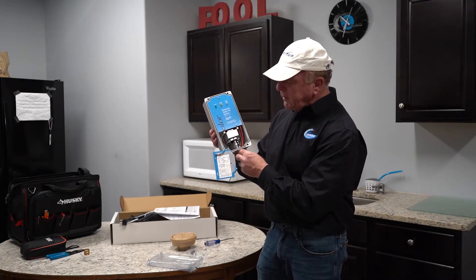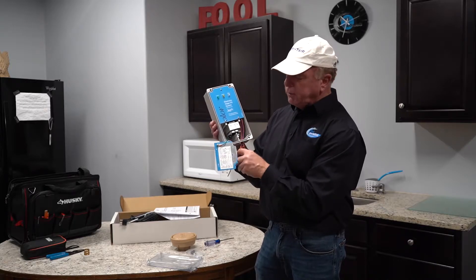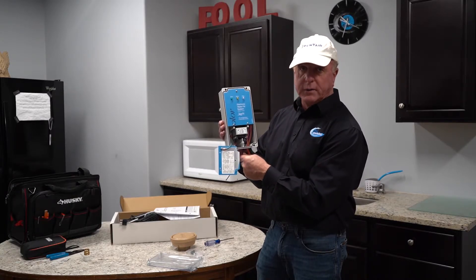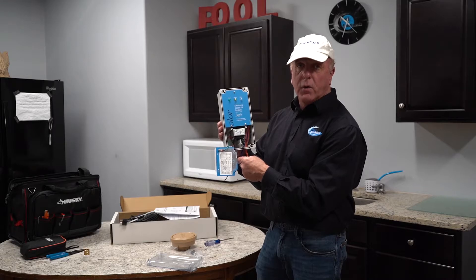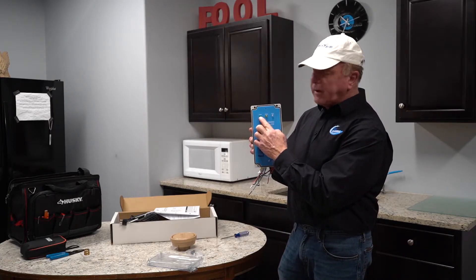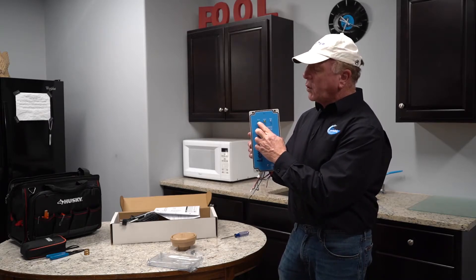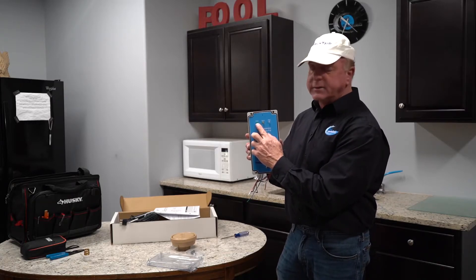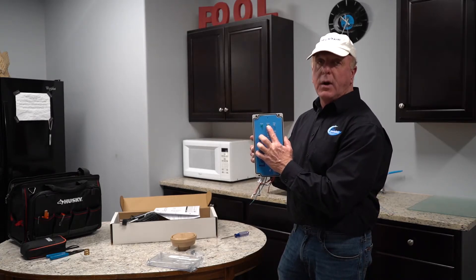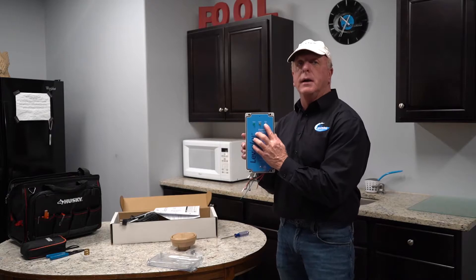In the low voltage segment you'll notice two orange wires and two blue wires. The orange wires go to the sensor and the blue wires go to the solenoid valve or autofill valve. On the top portion you'll find three lights: a power light, a sensor light, and a fill light. Once power is connected, the green power light will be on. The sensor light turns on when there's a water demand — i.e., the sensor is not touching the water. And the fill light will turn on green until it times out.